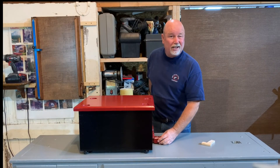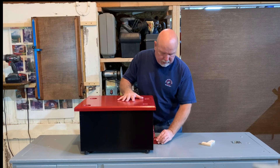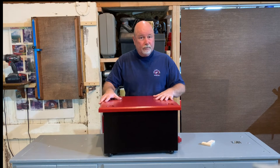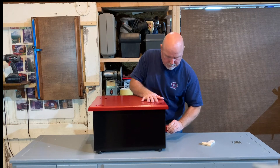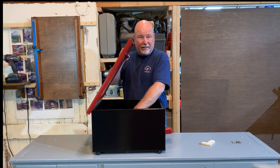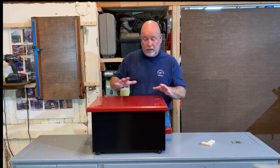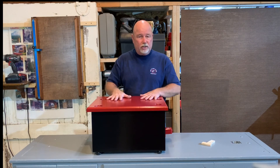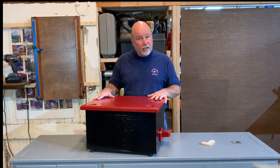It's going to take a little bit more work to make it as smooth as I want it, but this is the finished cabinet. So now if I push down and in on the lock, the cabinet is mobile. That's pretty cool. If I pull the lock out and up and push it back in, the cabinet is stationary. Anything I put inside pushing down will not lower or engage the casters. So I can take my materials out of the box, use the wheel, put materials back in the box, and it's still stationary by locking it like this. That's the lock mechanism — that's the final assembly on the cabinet.